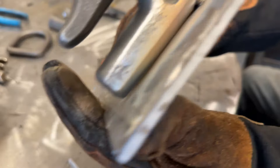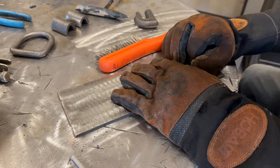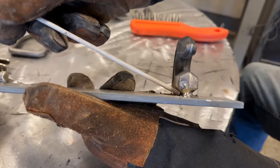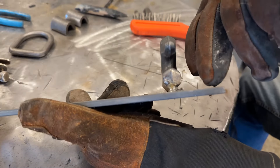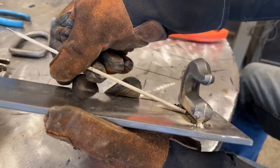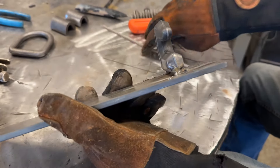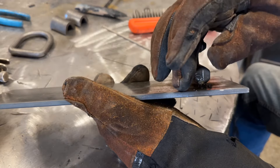Nice tack - you can see it pulled it up a little bit. That small gap will give us better access to get the rod in. I'm going to bend this up very slightly - be careful not to break it. Now I'll tack it down on this corner. Look at this angle: the rod can get in there literally to the root. That's what we want. The hook is leaning a bit, but that's okay - when I put the root pass in, it's going to bend right over and give me more access on the other side.